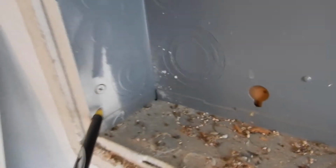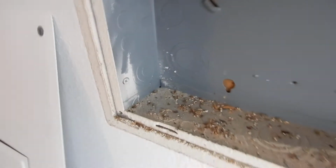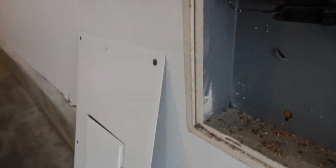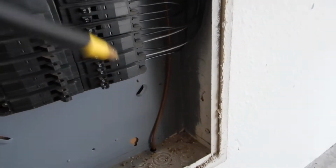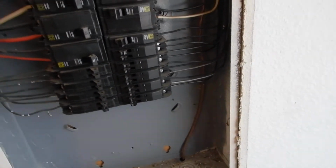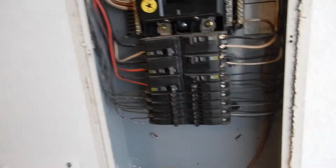How about this one? Screwed in place. Screws are faster and tighter, I get that. You ever build a treehouse? Try to take a treehouse down. Nails have much more shear strength. Nails are faster, but screws don't have the shear strength. They don't have the tensile strength. They pop, they break. So if this structure was to experience a tornado, for example, you've had a bad day. A tornado doesn't blow up your house, but if this cabinet had been nailed in place rather than screwed in place, it'd stand a better chance of staying in place. That's why they have rules like that.